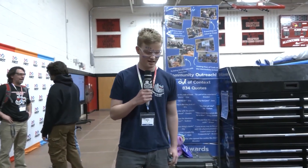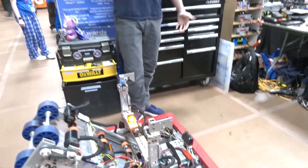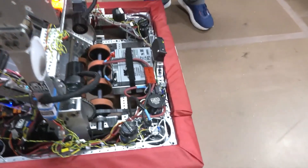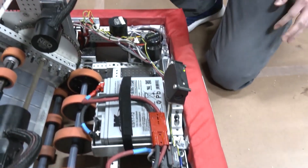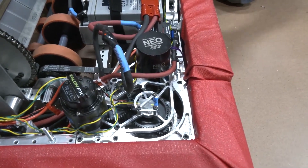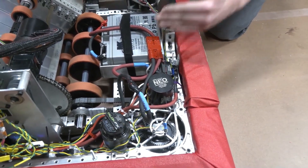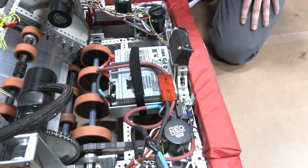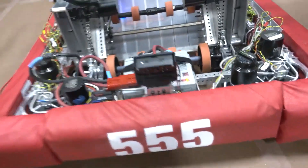Max, let's start bottom up on this robot. You're doing a flipped or inverted swerve as well. So we very quickly realized that if we wanted to do an under-the-bumper intake, we would need a lot more space than our current swerve module configuration would allow. So we decided to invert the swerve modules. We put the top plate up above with our entire frame perimeter higher, and also inverted our motors fully — flipped them completely upside down — which gives us that extra two or three inches of space for the intake, allowing us a much wider, touch-it-own-it style intake.